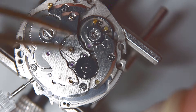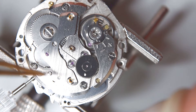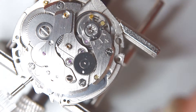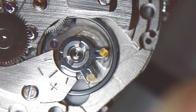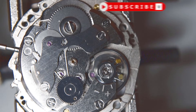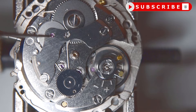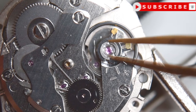When I install the balance jewel with the balance spring, we will actually be finished. Let's secure the bridge with these two screws — that simple. Showing you how I put back the rotor is pointless because it is quite easy. Let's do now the balance jewel — that is more interesting. Also oiling here and also this wheel — now the balance jewel with its spring.